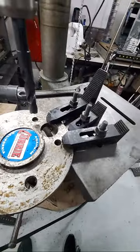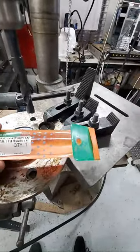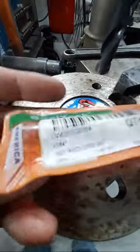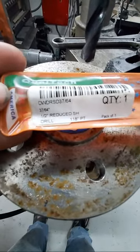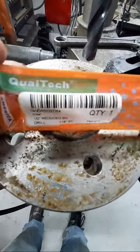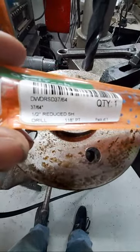What we're going to do is, for that part number with the 5/8-inch knurl, you're going to want this bit. This is a 37/64ths drill bit. You can find this online somewhere. I bought this individually just for this job — most big box stores are not going to have this. You need to get it online. 37/64ths.